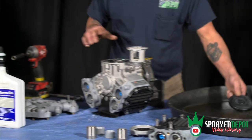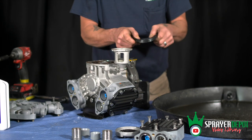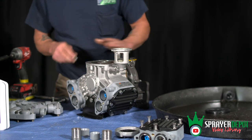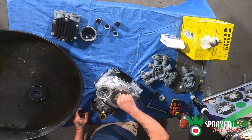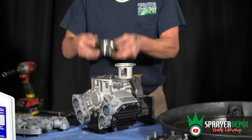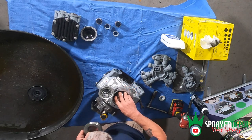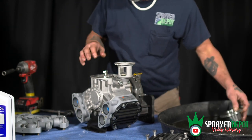There's your diaphragm. Normally it will be cracked — if you see any kind of tears in them, then you know it's actually worn and you do want to replace that. Now we want to pull this sleeve out; that's basically holding the piston in place. Normally you can take the diaphragm bolt and tighten it down a little bit and then just wiggle that piston out. There's a ring around this piston, so when you go to take it off, if you struggle getting it out, it's because that snap ring in there is actually holding onto it. There are a few tricks to wiggling that out.